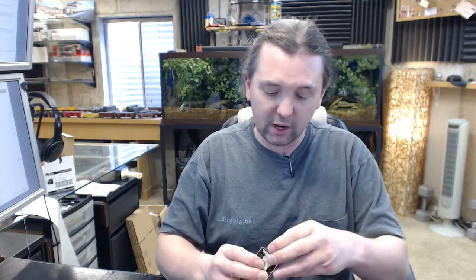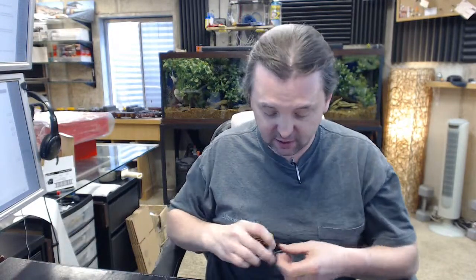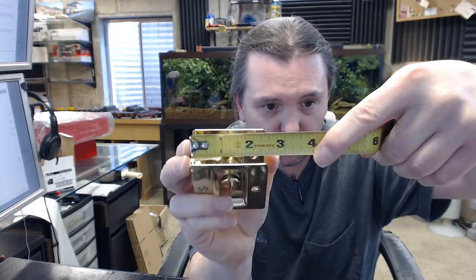That hook comes up from the top and that slot in the hole provides the clearance for it to work. There is no template available from Ultra for this and there are no installation instructions unfortunately. You are going to have to do your level best to just eyeball much of this. Generally what you will find with these sorts of locks is that you are going to create a notch in the edge of the door, and that notch needs to be something in the range of 1-7/8 wide. This is just a guide — this is not what you should manufacture to. You should probably wait, get the hardware, and do your own review.